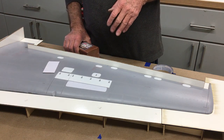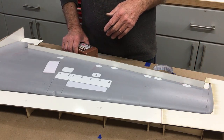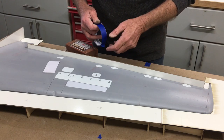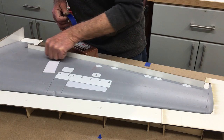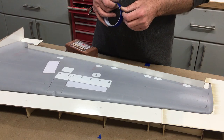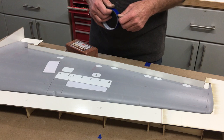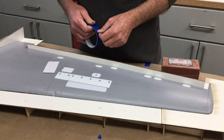I'll clean everything up, just check everything, and then I'm gonna find where the detail is — like here. I'm gonna put some tape over where the rivets come right up to the edge, because I don't want to get clay in those. I mean, you can get it off with a little isopropanol alcohol, but it's easier to just do the tape.